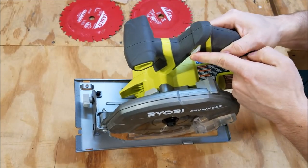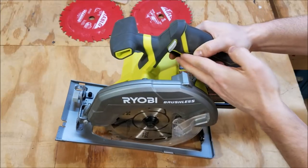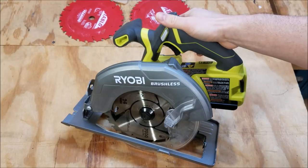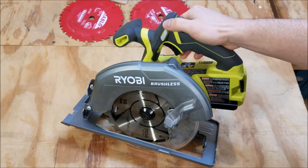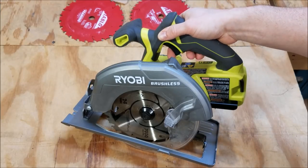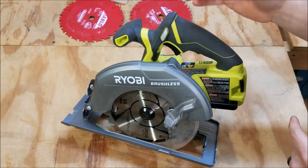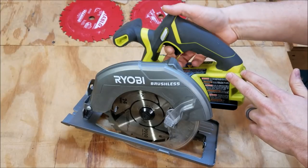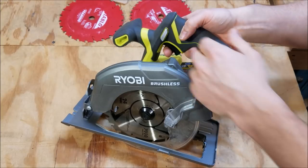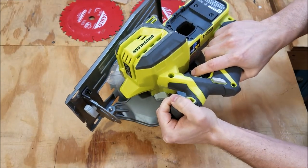On the handle you've got a lock-off trigger — you've got to push it sideways from either direction as an extra safety measure, and it's not actually that hard to actuate. I'm used to most saws where you push down rather than pushing in, but the way this is angled it worked really natural for me. The grip portion next to the trigger is a little bit deep, and a lot of the time I found myself using my middle finger instead of my index finger to actuate it — it depends on the size of your hands. The pommel grip up front is nice and pretty standard for a circular saw, letting you get better control with two hands.